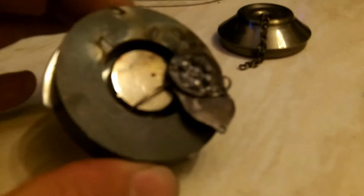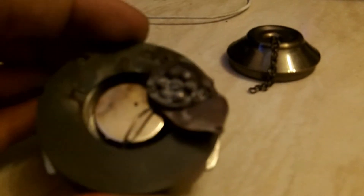Okay, magnetron sputtering today. This is my magnetron gun — as you can see, it's already been used. These are two silver earrings which are my target. Not precisely laid, as you can see, but that's how we're going to do it — it was nice and quick to get them attached. In future, if you wanted to do this for making transistors or semiconductors, you'd need a target going straight across — something nice and flat, like a flat silver coin.